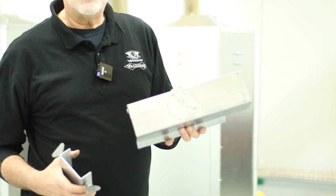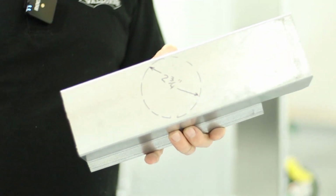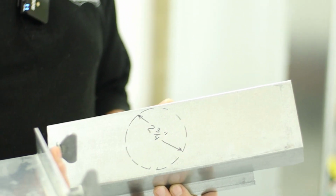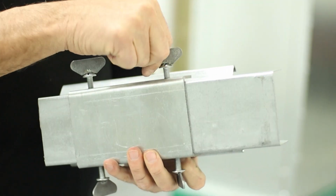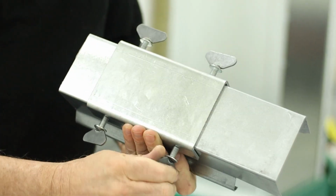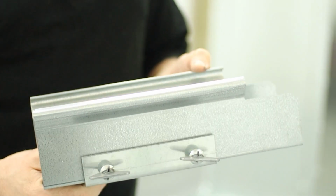Okay, as you're putting your trough together, you may want to put a trough clean out hole in the piece that goes just before the drive bin. The drive bin is just before as viewed in the direction that the chain is traveling. So it'll be a 2 3/4 inch hole, and then we have a trough clean out cover that goes over top of that and is just held in place with thumb screws. You'll run with the cover on unless you're cleaning out before the system starts or in between flocks.